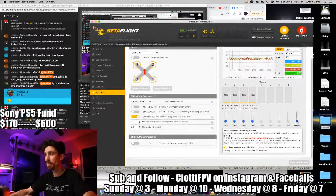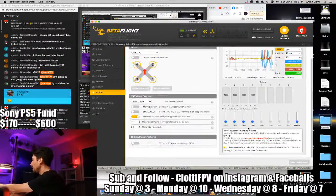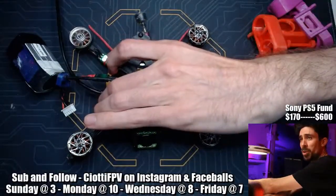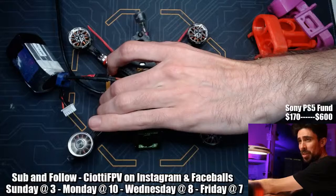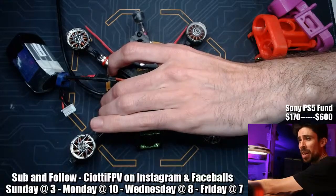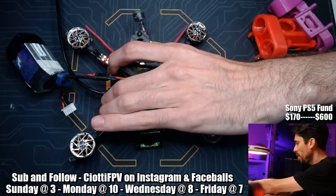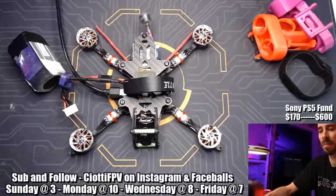Now we can pull this master slider down. This is also your opportunity to see how a clean motor feels. So reach over, pick the rig up, spin these motors up, and just give yourself an idea of how many vibrations these motors, when they're brand new, are going to give you. As you start beating these motors up, you're going to do this test again, and without this baseline, you're not going to know what the cleanest they can possibly spin is. You want to do this on every single build. So these are pretty clean. They're not perfect, though. I thought these would be a little bit better than that, but they're totally fine.